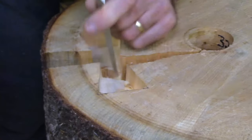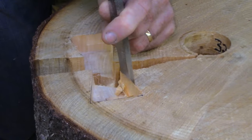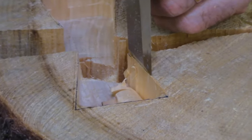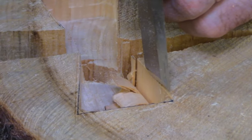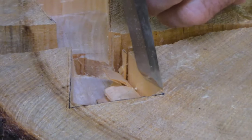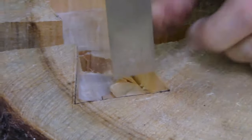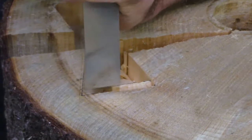So I'm just going to use my 1-inch chisel in this manner. I'll just pare a little away. Now I'm going to seat it right into the knife line and hold it as close to 90 as I can, which is probably dead on. So Tom, you mentioned something that there was a question about earlier, what the difference would be to do this on end grain versus cross grain. And you just said something that referred to that. Is there anything else you want to say about that?